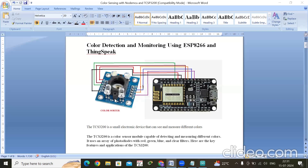This color sorter has 5 pins on the left side and 5 pins on the right side. VCC and ground are given on both sides, so there is no need to connect VCC and ground on both sides to the NodeMCU. Choose either the left side or right side. VCC of the color sorter is connected to the 3.3V pin of NodeMCU, and ground is connected to the ground pin of NodeMCU.